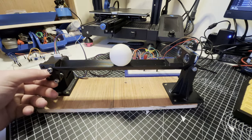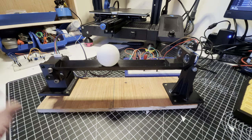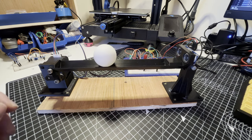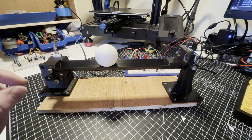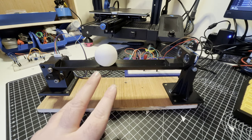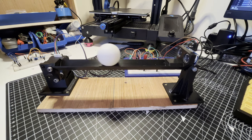First thing it did was it basically set the motor at the very start for about two seconds so that it's not quite on, giving you some time to calibrate the sensor because it uses a Kalman filter under the hood. There is a little spike at the start which I wanted gone, and also I wanted the motor to effectively be off when you turn the machine on so you can move it around to position it. We're more or less at the set point here.